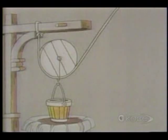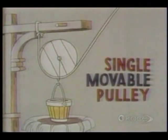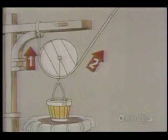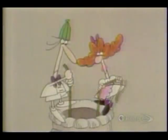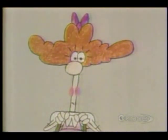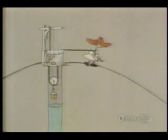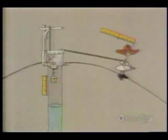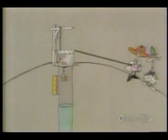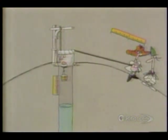When a pulley is arranged like this, it's called a single movable pulley, and it halves the force you must exert because the pail of water is now, in effect, being lifted by two ropes instead of one. It's as if two people were lifting the pail — it looks as if we're getting something for nothing, but of course we're not. If we compare the distance that Jill raised the pail with the amount of rope she pulled, we see it's the same old story: what she's gaining on the force, she's losing on the distance. The distance she pulls the rope is twice the distance that she raises the pail.